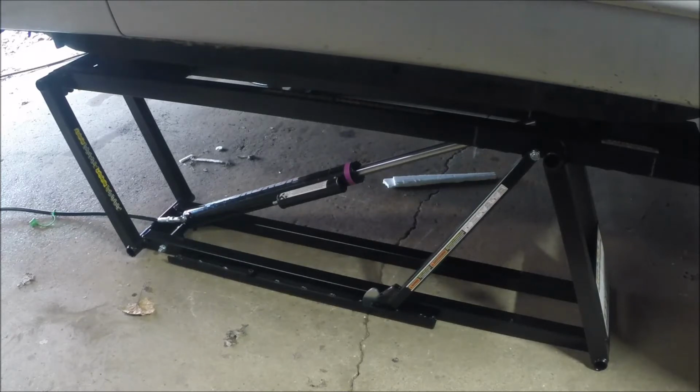I will say that this ain't plug and play. They do work. Takes a little bit to get them set up and going. They're not ready to go out of the box. You've got the fitting situation where now they say that you can use thread sealant on the threads if you want. You have to be very careful about your Teflon tape, because if you don't do it properly, you end up with Teflon tape in the hydraulic system, and it monkeys up the valves and you're done. So the liquid thread sealant is a better option, but in most cases you've got to wait 24 hours between putting your fitting together and ready to use, otherwise you're going to have some leaks. So that's one thing.